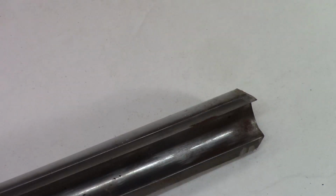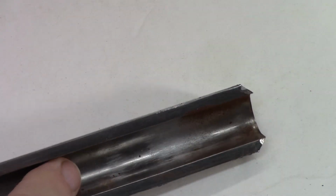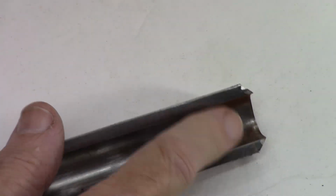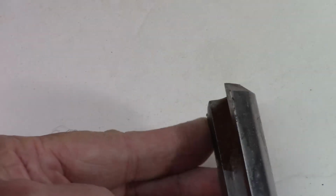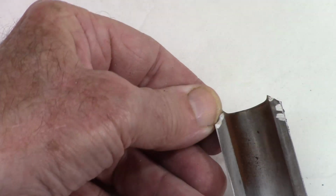Another example of improving the basic grind, it's not as clear on this spindle roughing gouge as it is on some, but some of them, this part here is completely rounded over, and that makes it much more difficult to come right into a shoulder and cut with this entire edge, because if it's rounded, you're not going to get a sharp edge right here.